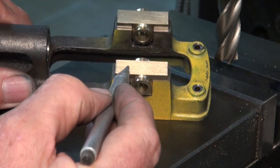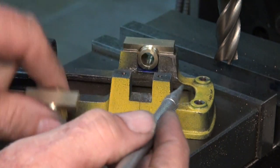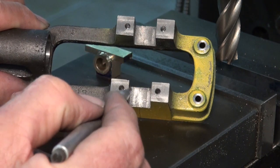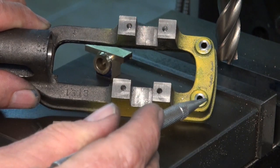And if I had any brains, I would have done this job first and then spotted through the bearing into the cast iron base. But you may recall that I got all clever and I drilled and tapped the cast iron first while it was on the CNC machine, thinking that that would allow me to get all of that process done in one hit.